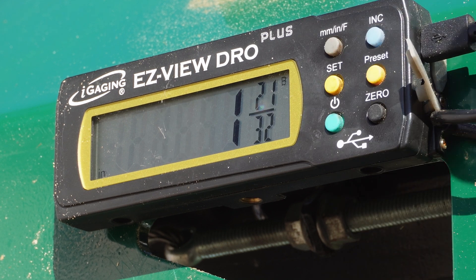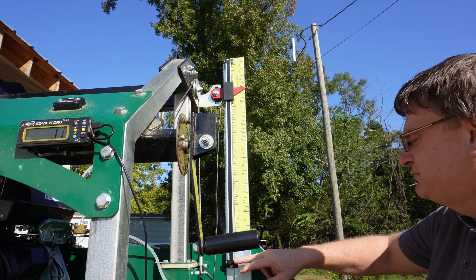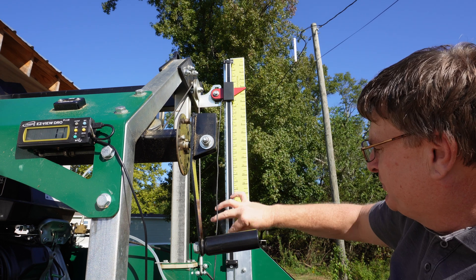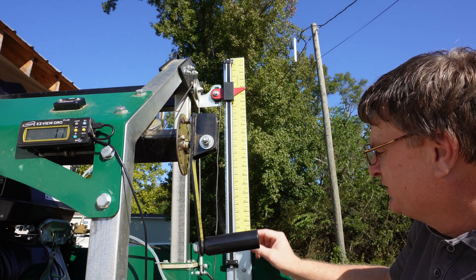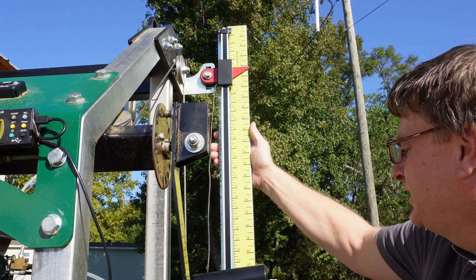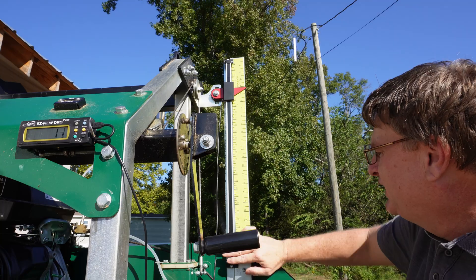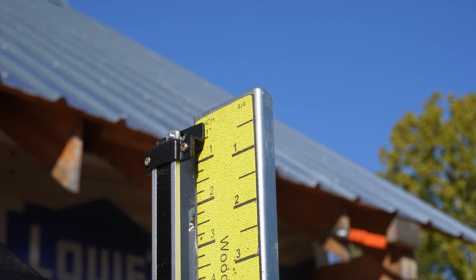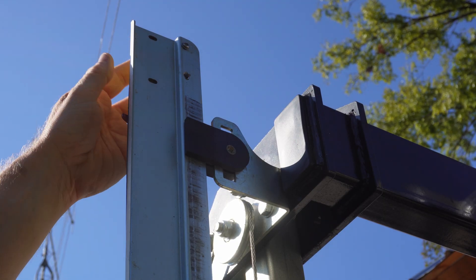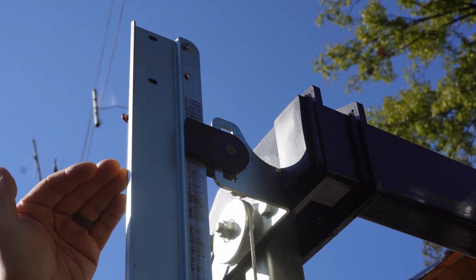To install it — it comes with different size tracks. I'm not sure exactly what you call this, but I put this ruler and mounted it on here. I had to make sure it's perfectly straight with the ruler that's on here, or with the metal that's on here. I measured this — this part moves up and down and then this part just stays still. I put one small bolt at the top. You do want to make sure that the ruler goes far enough up so when the blade's all the way down you'll have enough room.